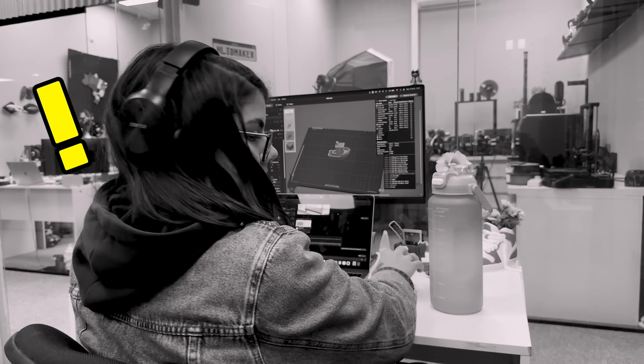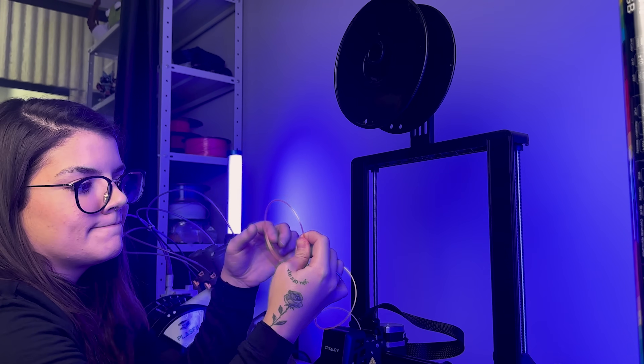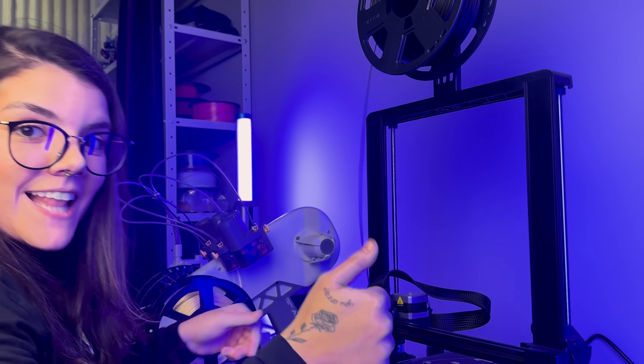Something that makes a big difference for me to avoid waste: with the A1, you can use your filament right up until the end, because it has a runout sensor to inform you when the filament is over. It pauses and waits until you put another one in. The Ender 3 doesn't have that sensor, which means you need to keep an eye on the printer whenever your filament is running low, so you don't miss your cue.